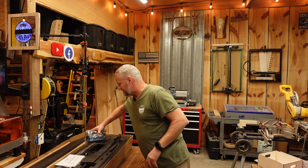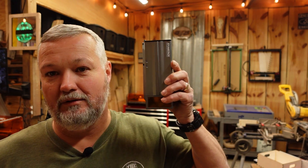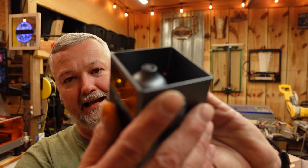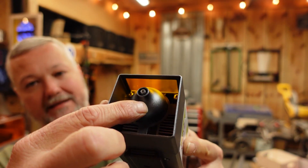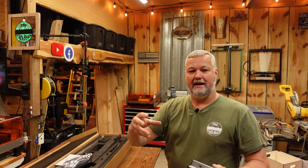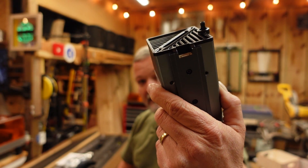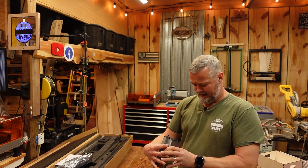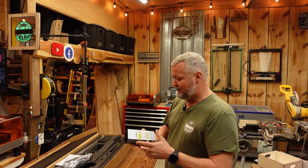The first thing is this is the new 40-watt module. Some of you said I got a big head, but compared to a 40-watt module from the Atomstack, it's not that big. The traditional design made popular with the A30s and X30s — as far as the nose cone goes, you've got two separate little pieces coming out. One is for the air assist and the other is a cone to bring some air from the module through to help with cleaning. The plug looks like the traditional plug that Atomstack runs — looks like a five-pin, so it is comparable to the V35 as far as the plug.